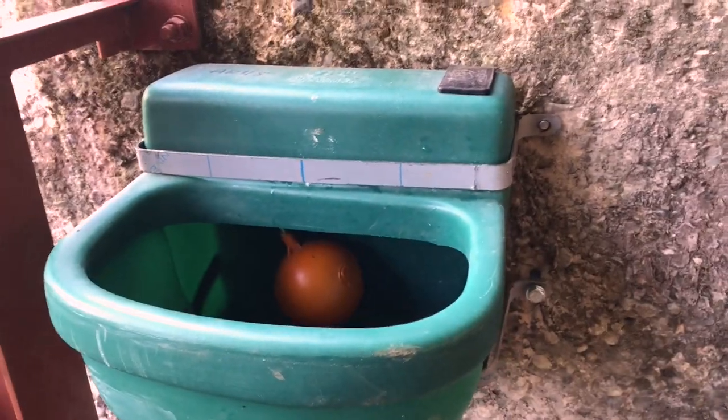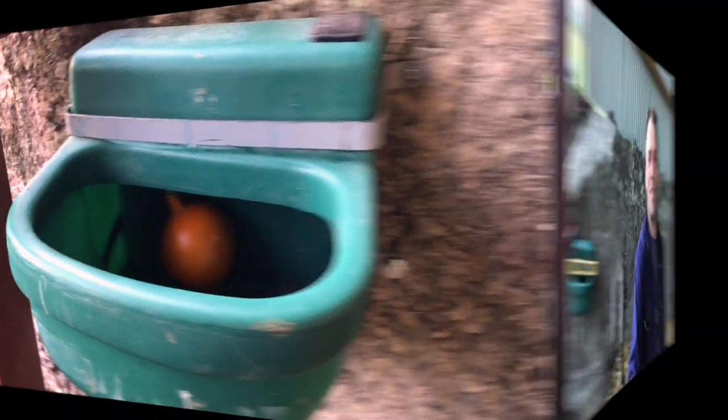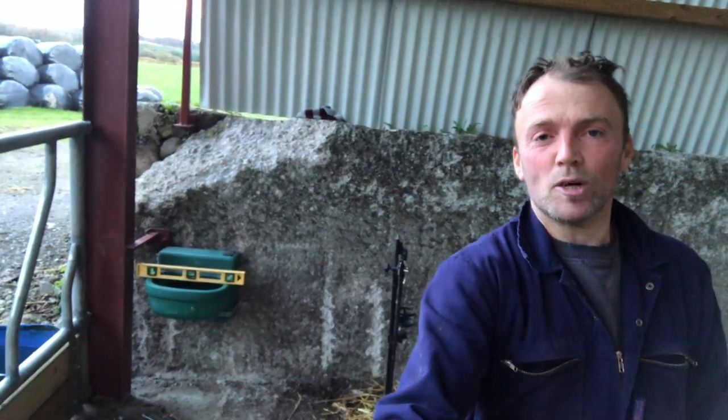It would have been an awful lot easier to go at this job before the cattle came in — I wouldn't have to kneel in that kind of stuff. But I think we're getting there. There's one side, the other side — if we can get the camera in there, that side and that side. So we'll tighten them up now and hopefully we'll be ready to start connecting in water pipes. None of these jobs ever go straight forward for me. I broke a couple of dyno bolts just putting them in wrong and had to go to the farm relief to get two more. But I think it's in place now. I tried to get it as level as I could and then put in the spirit level just for the camera, so it kind of looks good anyway at least.